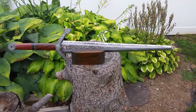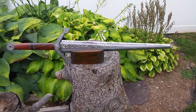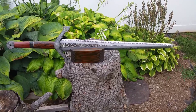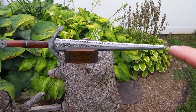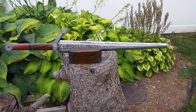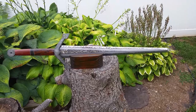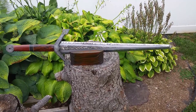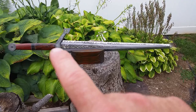Let's get into the specs. The design is Brett's design, with a few things we developed and agreed to change along the way as things progressed. It's three inches in width down here, down to about one inch wide at the tip. The steel is S7, hardened by Peter — 58-59 Rockwell. S7 is a great steel for impact resistance, so if he were to use the sword against something hard it wouldn't shatter, and that was important. The thickness of the steel is one-third of an inch, which is what Brett wanted.